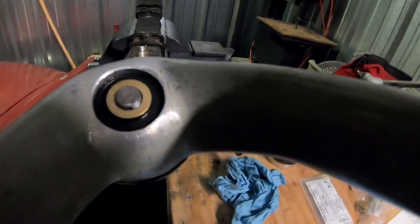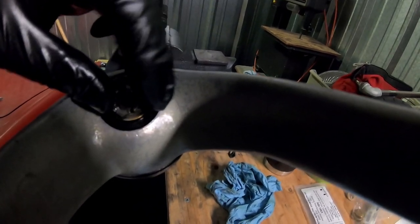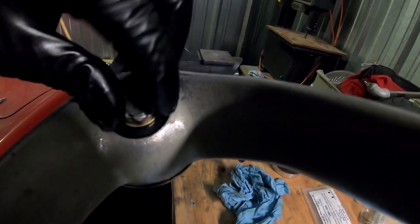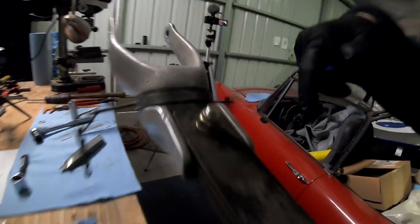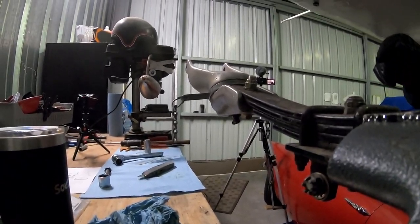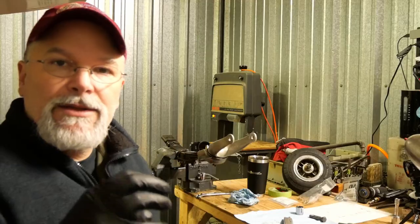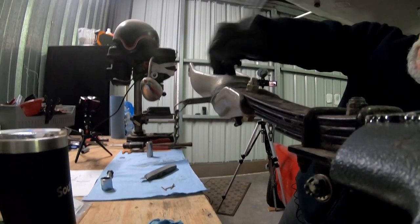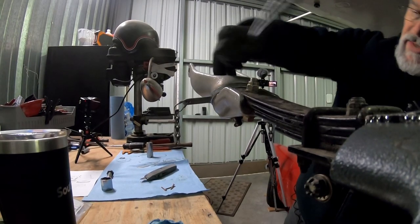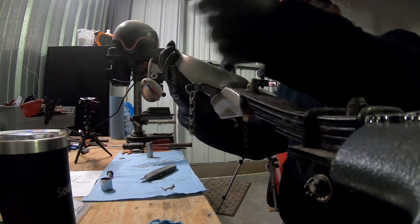We're gonna put a washer, the castellated nut, and you'll notice you're gonna start off with a gap. You're gonna notice that gap is in there because those five springs are pushing against the two friction plates. Start tightening this up. Once it starts getting close to where you see that gap going away,